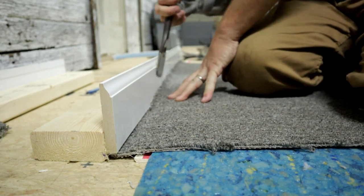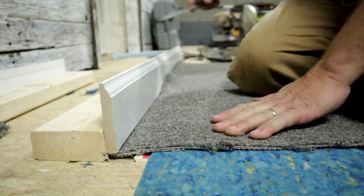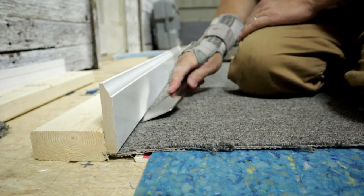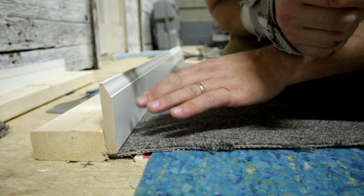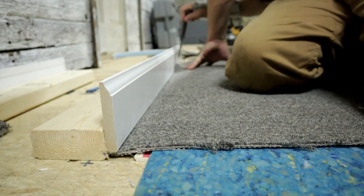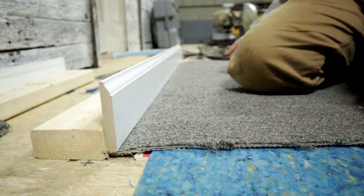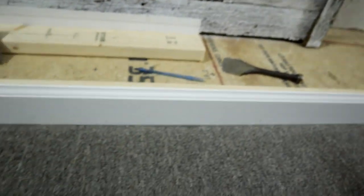I did a video here a while back called possibly the worst carpet job ever or something along those lines. And this was the case all over the job, okay? The tack strip was definitely too far back, okay? Let me show you this right off the bat. Let me go ahead and tuck all this. And the job that I showed was not even with commercial carpet. It was with a regular carpet, okay? But this was the case. The tack strip was too far away.